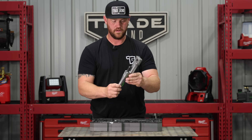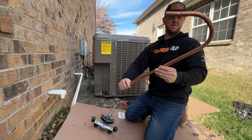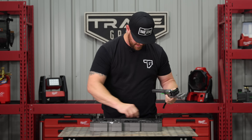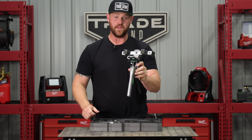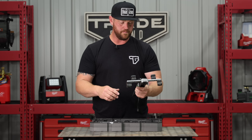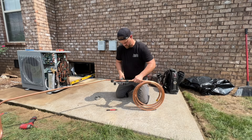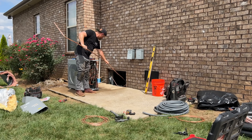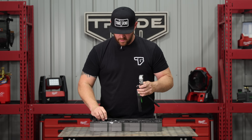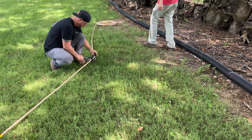Or even 90s — because if you grab this tool, you can actually bend your copper. You can bend offsets, 45s, 90s — whatever it is. So that's for three-eighths, and then you pop this guy on. You can bend whatever degree angles that you need, so you can even make fittings if you need to. Or you can bend the copper that's already in the field and create a 90 for yourself and just keep going. It's very versatile — this allows you to customize your refrigerant lines in the field or make fittings if you need to.